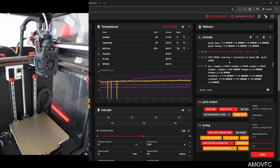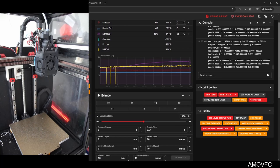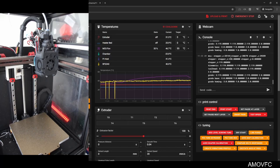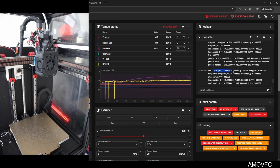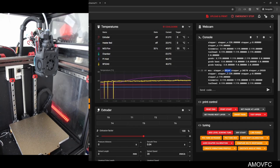I got up to 30,000 acceleration, but when I tried to increase my speed over 500mm/s — which is my current maximum — I instantly ran into issues. You check whether the stepper is skipping steps by looking at the numbers. I'm using a threshold of within 10: if the numbers are within 10, I can keep increasing speed. If I hear anything bad or the numbers get too far apart, I stop.